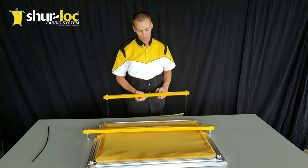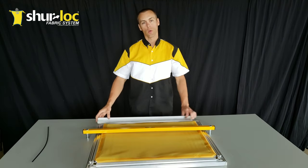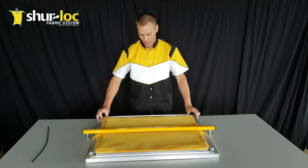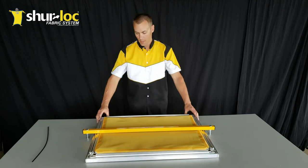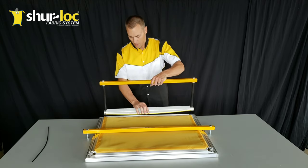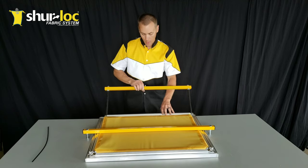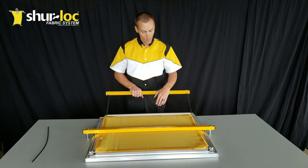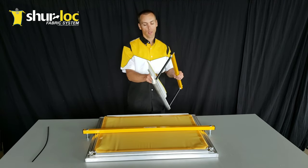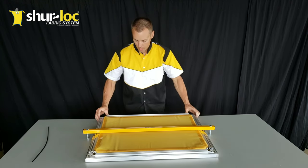Come back to one of your long sides - this is where we're going to use the tool. We've also got our elevation stick, which comes with your easy tensioning tool kit. This is essential to slide underneath - the height of the safety bar is really critical because if you can form a little bit of a wedge underneath there, that's going to give you a nice amount of pressure when stretching. Install the stretcher strip into the tension bar and make sure that it's fully seated down so that when you begin to press down it's not going to lift out.